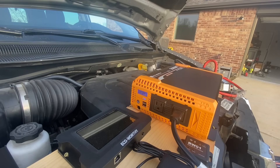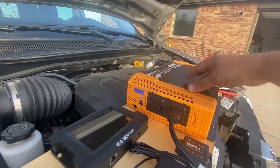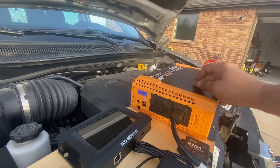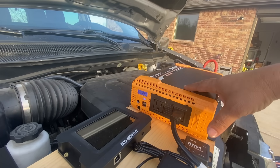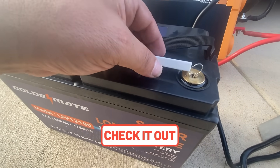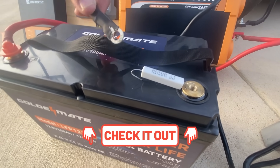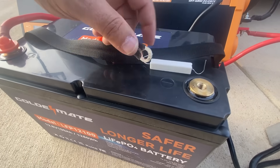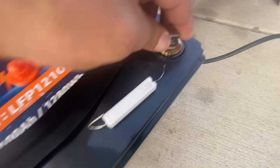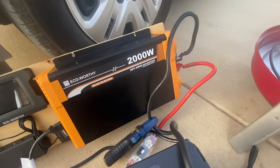Now I'm going to show you the advantage of the lithium iron phosphate battery instead. The voltage is at 11.4 — the only reason it's still running is that the EcoWorthy sine wave inverter is awesome and can handle lower voltages without issues. To keep equipment from arcing you can buy these resistors — very inexpensive, I paid less than five bucks for two. Use them on the negative side for a few minutes, let it charge up, and there won't be any arcing or sparks. I'll leave a link in the description.